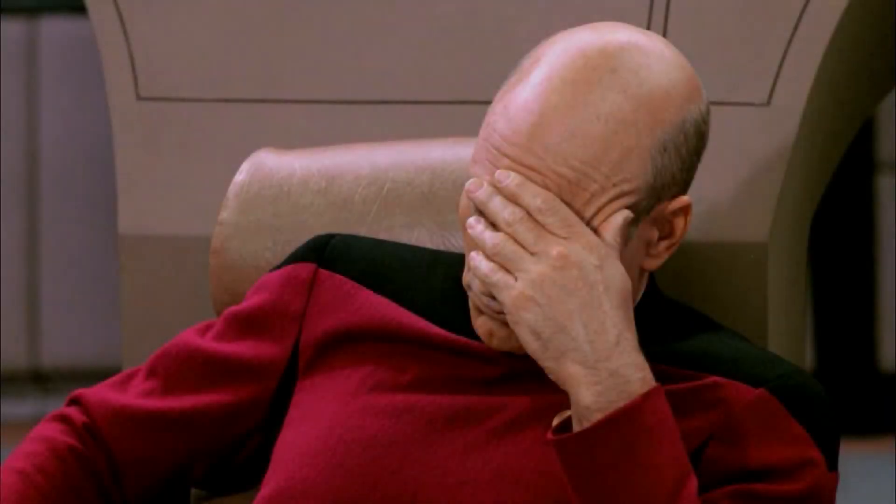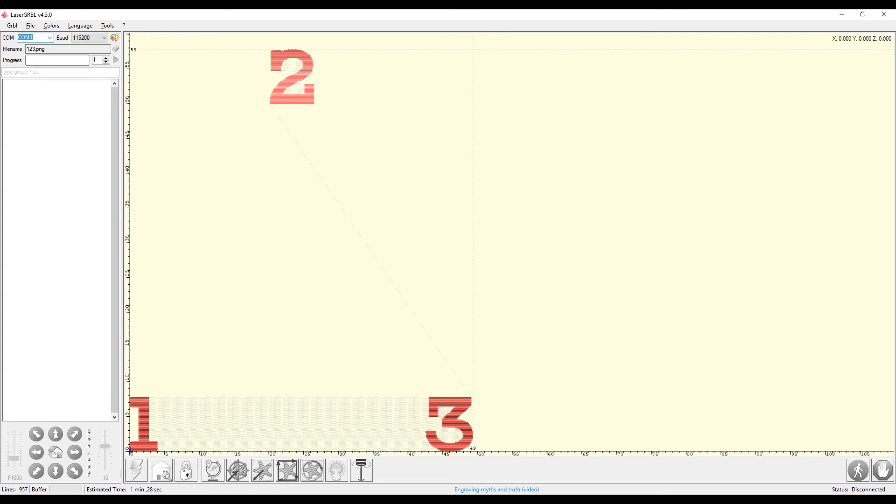Now if you were drawing a circle, you'd probably draw it like this — you put pen to paper, move it over the part of the page you want marked, and the pen is drawing the entire time without leaving the page, and no movement is wasted. You wouldn't draw it going across the page row by row, putting your pen to the page only when you want it marked and lifting it the rest of the time — it would mean the pen has ultimately travelled the entire circle, including the blank centre space, and that requires a lot more movements. The reason I'm telling you this is because this is how LaserGRBL does it. So when there is a lot of blank space between sections being engraved, the result is a lot of wasted movements. The wasted movements are shown by LaserGRBL as a shaded light grey area. There's a pretty minimal amount for this job, but for some jobs it can add up and cause the job to take much longer.